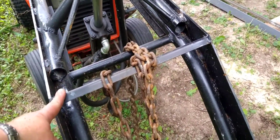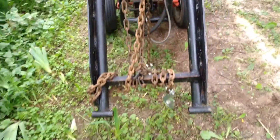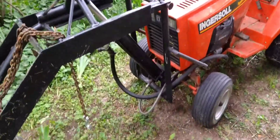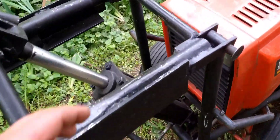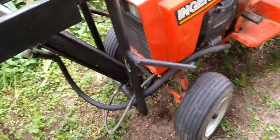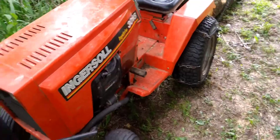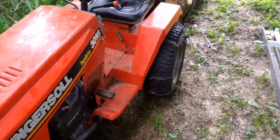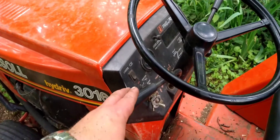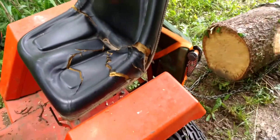With the reinforcement I also put in some more cross members, which has helped substantially. This design is great with the single cylinder - everything's working out really good. The cylinder has more than enough power to lift a car if needed. Other things would break, but I don't doubt I could lift the back end or one side of a car. The front axles are my weakness - the tractor's a two-wheel drive. Being a hydraulic drive, it goes just as fast in reverse as forward - you just move the lever, no safeties, no seat switch. I like it.